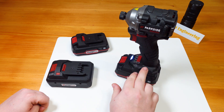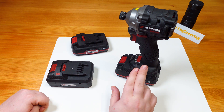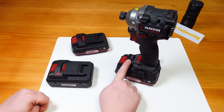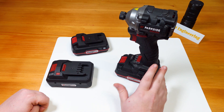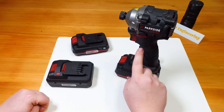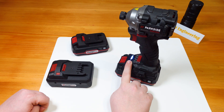As far as going to sleep when it's been used, there is a 40-second timeout for it to go into sleep mode. As you can see, the LED for illumination goes off. Once the torque LED goes off, it's in sleep mode. The only way to reset that 40-second timer is to pull the trigger sufficiently to turn the motor. It is not enough to pull the trigger lightly to light this LED.